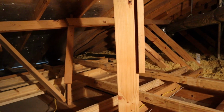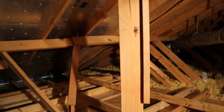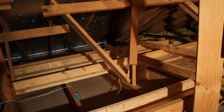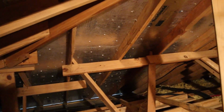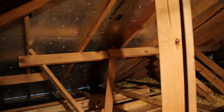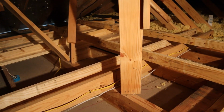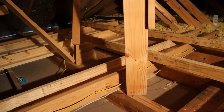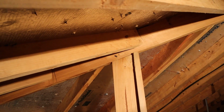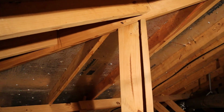All right, we're up here in the attic, and right in front of you is one of those braces that I told you about that runs from the ceiling joist all the way up to the rafters of the roof. That one and that one right there, granted that one also hooks into a longer type of brace system, are the two that I had to deal with putting the ceiling of the garage out by an inch. As you see, cutting that would have been liable to make this roof sag. And as you can see, like I told you, this is all stick built and not trusses.